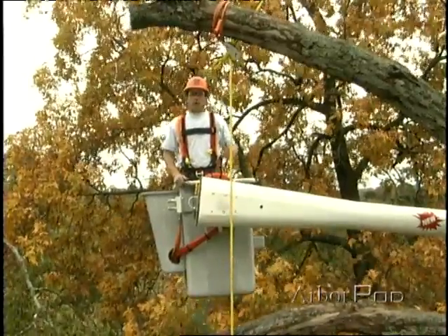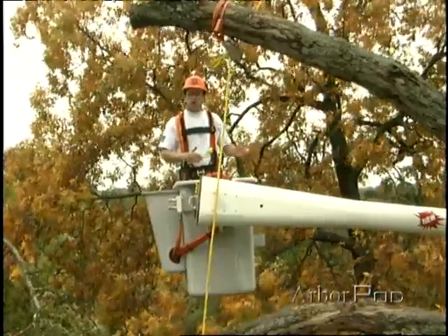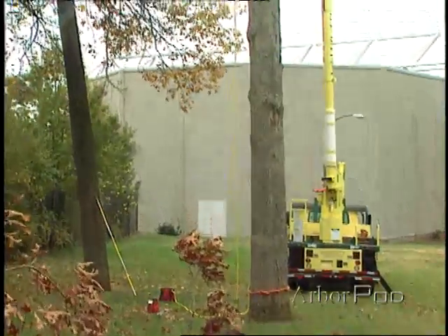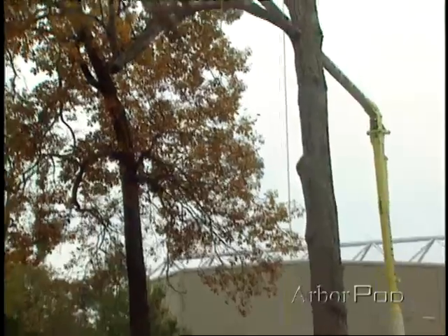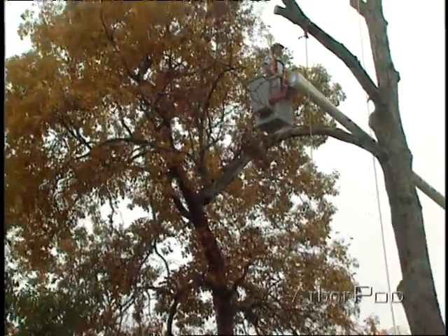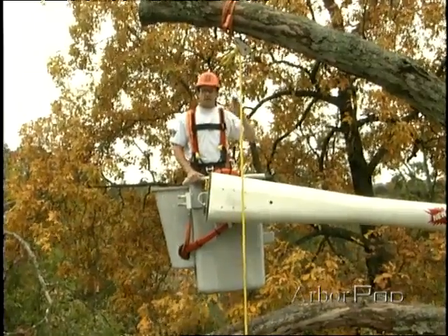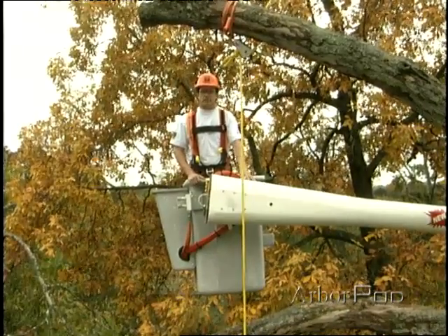Placement — where do I want to place myself, the bucket truck, the booms? All these things are very important. First off, when I place the truck, the aerial lift itself, I need to think about whether it will be out of the way of swinging limbs or dropping logs or limbs. I want to make sure that it's out of the landing zone. The same goes for the boom itself — I want to make sure that after I cut a limb, if it's going to swing, it swings away from the boom and not towards it.